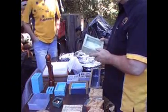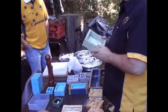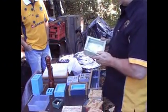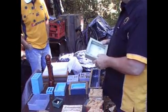And they say silicone doesn't stick to anything. Well, if you don't use release agent, it does stick and it sticks well. So I actually had to cut this off every inch, and that's why there's big carvings out of it.